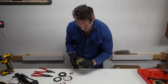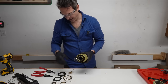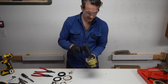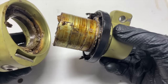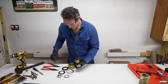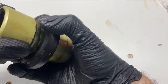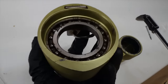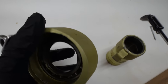Now this inner piece should press out. We're first going to try to tap it out using a hammer and see if we can get it to move. So there's another circlip in there that has pushed out this seal — interesting. We'll take this circlip off now, and then this last seal should just pull right off. We'll get all these parts cleaned up and then stick this last part in the oven at 250°F for 10 to 20 minutes. I'm hoping that the aluminum will expand more than the steel and this bearing should pop out pretty easily.